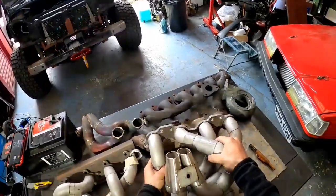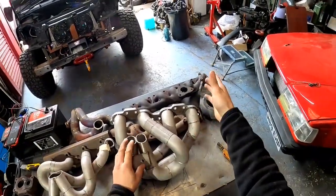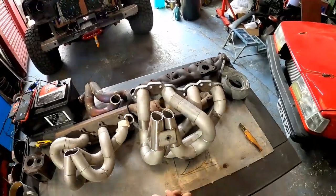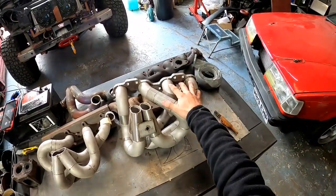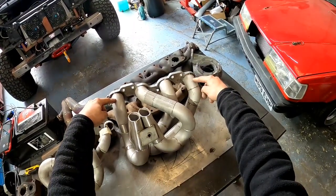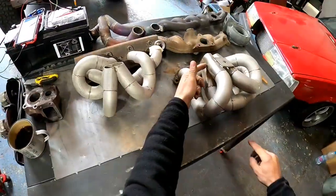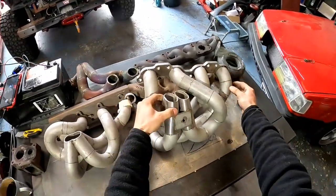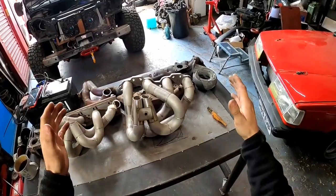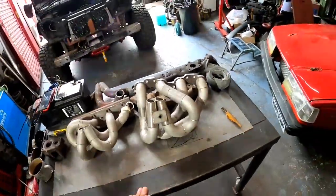All right, now how you build a twin scroll exhaust manifold. The proper way to do it is to find out the proper firing order. Like I said, on the 6 cylinders, the firing order is 1, 2, 3, 4, 5, and 6. Very simple to build exhaust manifolds for this. In the 4-cylinder engines, the story changes a little bit, because the firing order is 1 and 4, 2 and 3. So what you do, you get 1 and 4 cylinders go into one scroll. You see, this goes here, and this one, if you follow it, here you go, goes into this scroll. So you got 1 and 4 into this, and 2 and 3 going into this too. Because this is how the engine pulsation works. You know, 1 and 4, 2 and 3, 1 and 4, 2 and 3, and they interchange between each other. So you got 1 and 2 pulses. And this is how it works brilliantly.